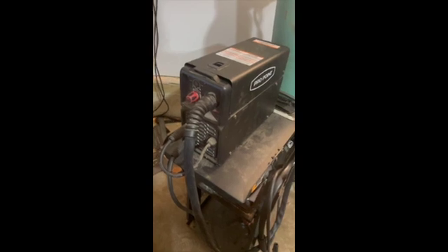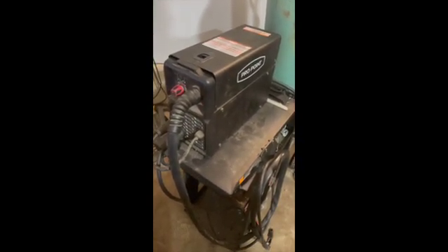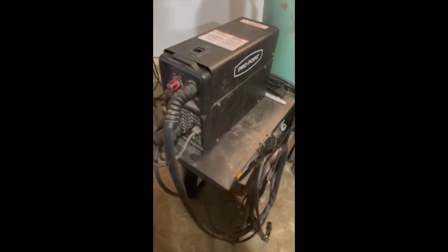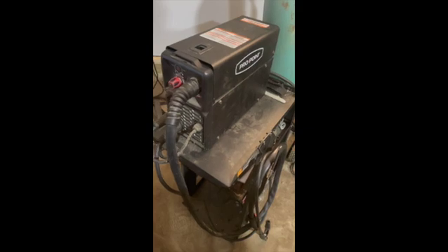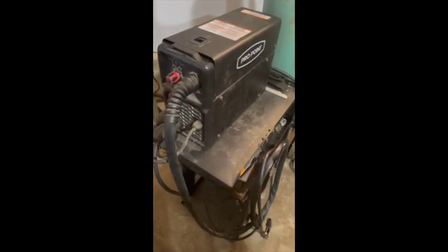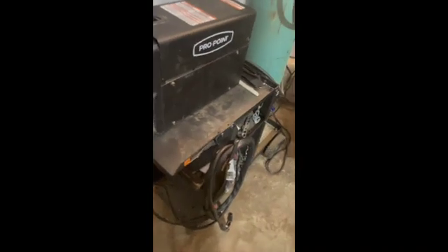If you're going to be welding on really thick material, you're fighting against the effects of a fast-freezing puddle versus really cold material and a small arc. That being said, can you weld with these machines? Absolutely. But they are more geared towards lighter gauge materials because you're not getting as much preheat. I have a couple of example welds — this one was just on some one-eighth angle.